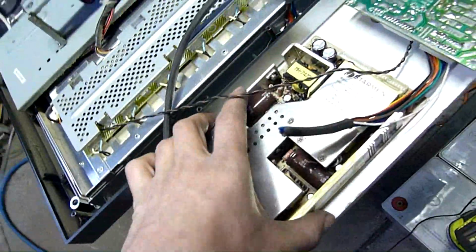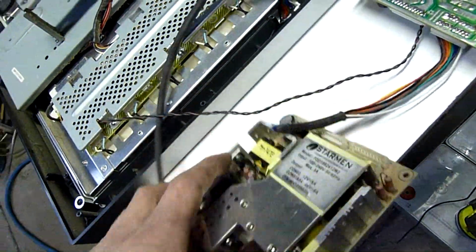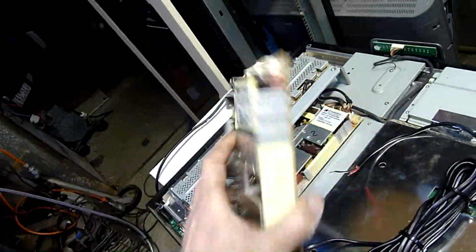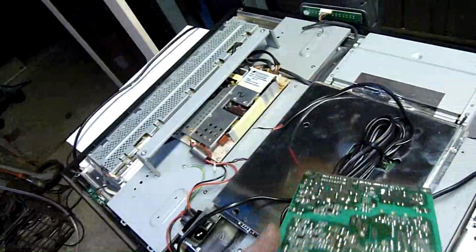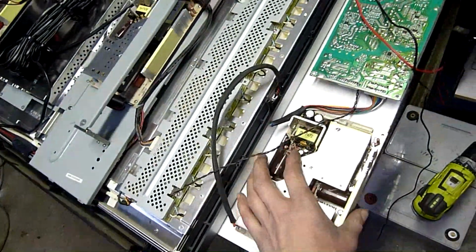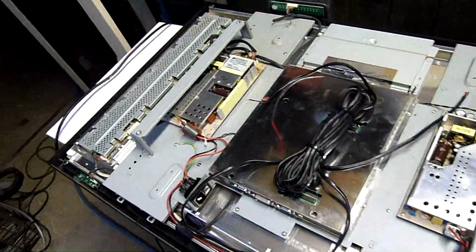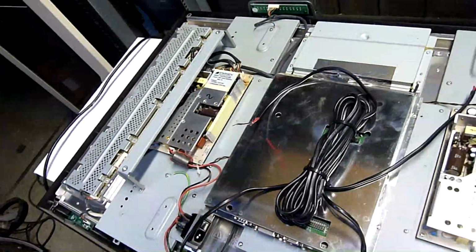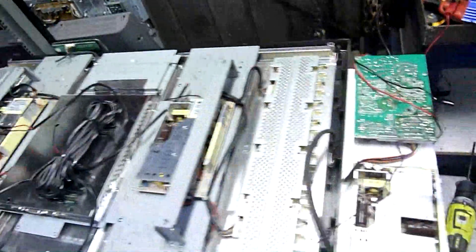Duh. Anyway. They're both exactly the same model. It's just one drives that inverter and has 12 volts piggybacked off it for the digital board, which has its own 5 volt regulation built in. Could be one of the reasons why they die. Maybe the regulation and filtering isn't the best and it's killing the digital chip with ripple. I don't really know.